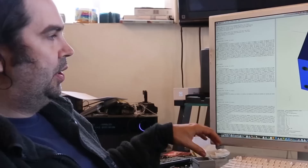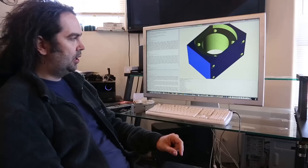There's the 3D print. I test fitted it on the ball screw and it fit perfectly the way I wanted. I printed it again at 103% to account for the shrinkage of the aluminum casting.